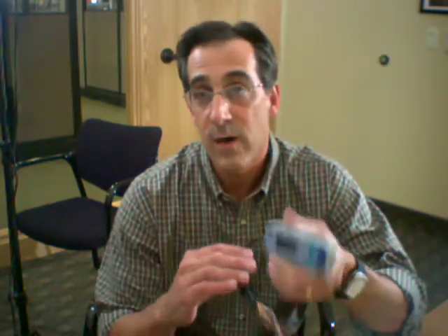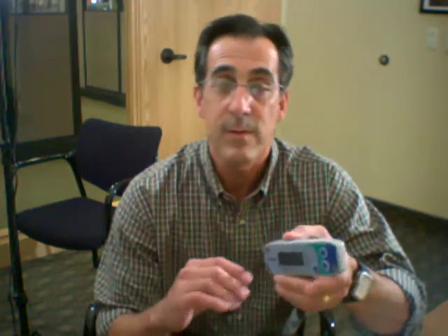And this is the module here. It attaches to our controller, similar to our ET system, and it's very simple to use. The whole premise with the Solar Sync product is that we attach a sensor and module to our controllers and have them automatically adjust controller programming based on weather. You attach the module to the controller and then attach the sensor out in the field. When these two are attached together to a Hunter controller, they will self-adjust the controller based on weather input.